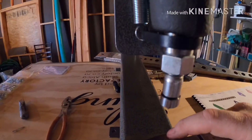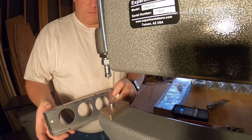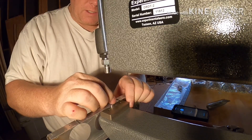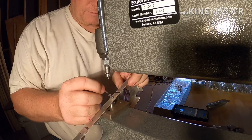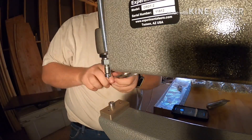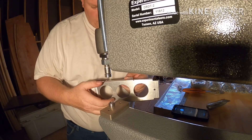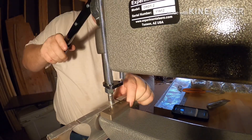I'm going to go ahead and show you how to dimple this. I'm going to have to get a tripod over here. I've got a close-up here — let's just kind of put this in. I'm going to dimple it. I need to get a new O-ring on my thing because it keeps falling out. Let's take this flush rivet. I may have to adjust that a little bit more and redo that one. Let's adjust this — turn it another quarter turn and give that one a try. Let's redo that hole. I just adjusted the dimple die down a little bit to make a bigger hole.